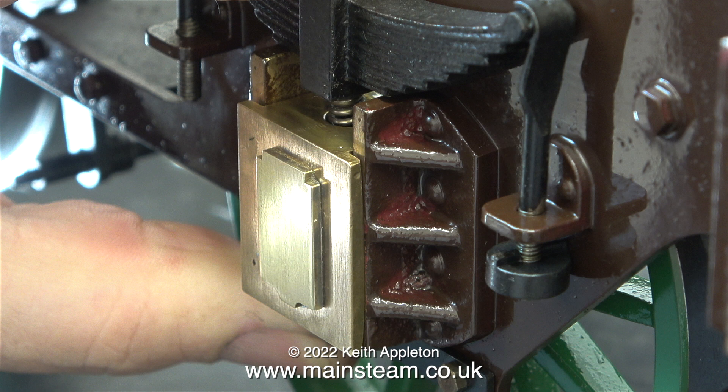This is a very important clip — there's some good information here if you look carefully. Can you see how the edges of the axle box are radiused? This is to allow the axle box to tilt, not just go up and down in a slot. When I make locomotive axle boxes I normally only make one flange, which is on the inside, but the design of this tender shows the horn blocks the other way round, so you have to put flanges on both sides of the axle box and also file a radius on the flange at the other side of the axle box.